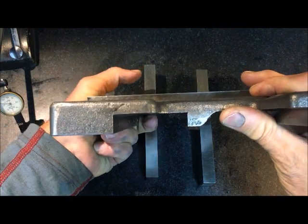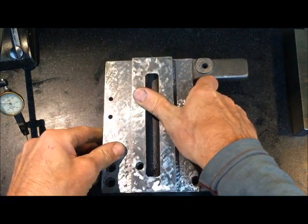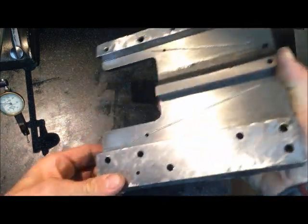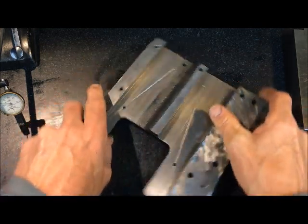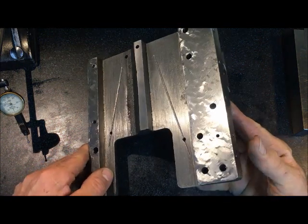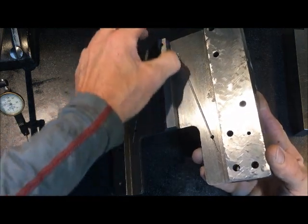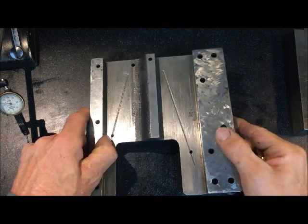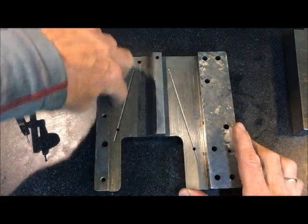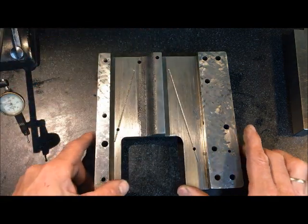So how this trailing edge can become so worn is probably something special. Anyway, I know this needs to be milled down. Because I already thought I would use the time to rebuild it from the narrow guide to the wide guide — so using this longer way surface instead of this shorter one here to guide the saddle.